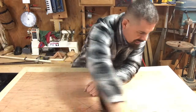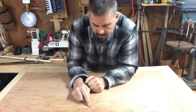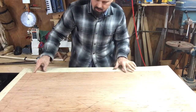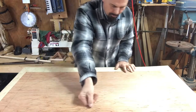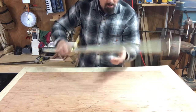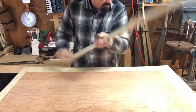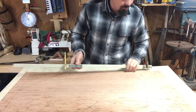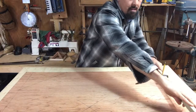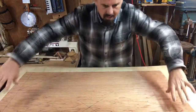Make a 36 by 36 inch square, snap lines from corner to corner to make an X in the center. Pull from the corner, swing an arc by driving a nail and pulling your tape — as you do on the job — to the side. In my case I'm going to use pivot points on a stick. Swing it to the side, make two marks per side, and so on. Connect the dots and those will be the eight different sides.